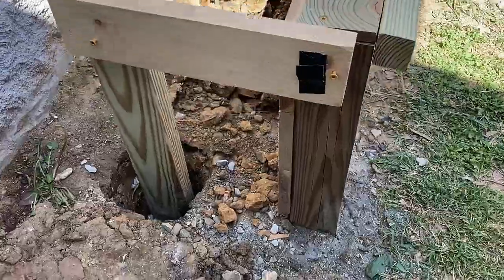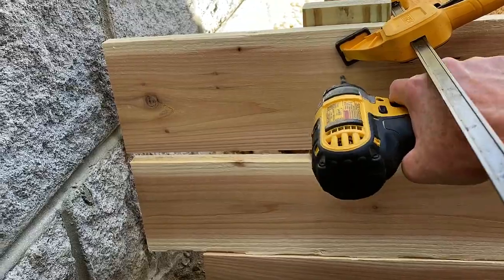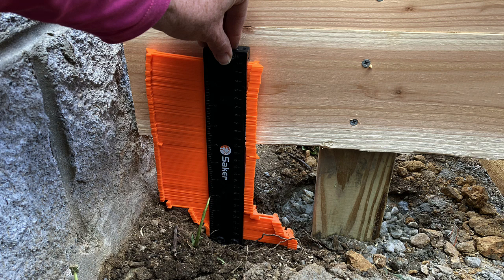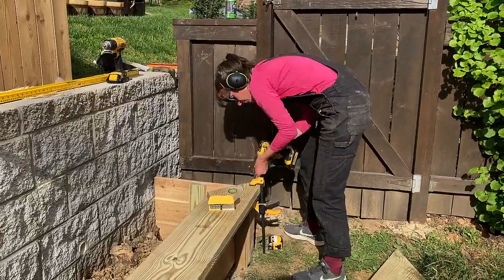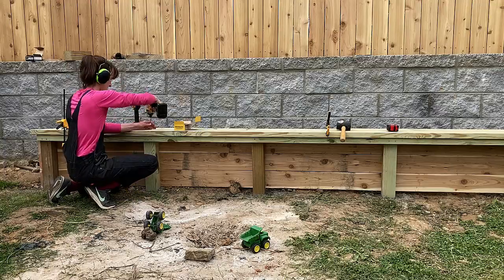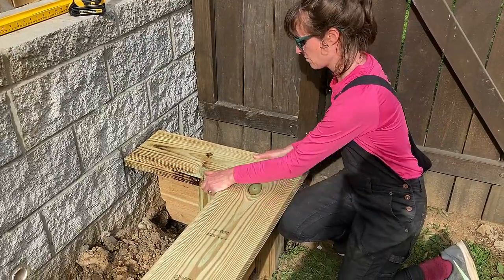Next, I had to figure out how to attach my sides to the masonry wall. I didn't have a helper, so I used scrap wood to support a 2x4. All my posts are pressure treated, which is important whenever you're cementing any kind of wood into the ground. I cemented in the 2x4 flush with the outside part of the 4x4, then attached the cedar to the outside. There was excess concrete from the footer of the masonry wall, so I used a contour gauge to transpose the shape directly onto a piece of cedar and used my jigsaw to cut out that shape. I used my miter saw to make 45-degree angle cuts at the end of each bench. I attached the bench top through the top of the 4x4s with decking screws and underneath through the 2x2s. This minimized the number of screws visible on the top of the bench, which looks a lot cleaner. Then I lined up the two sides and attached those as well, adding two screws where the miter edge is connected to make sure they stayed together.